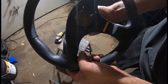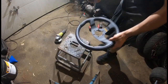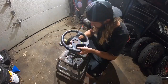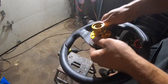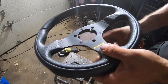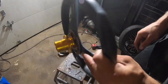Looks like we got a problem here. The three allen keys don't fit in the steering wheel. I'm just going to hit them with the grinder and make it work. Here's the final piece — we got our quick release and our modified allen keys that lock into the steering wheel. It would have been so much easier to just cut the steering wheel, but I did not want to ruin this Momo wheel, so cutting these little allen keys was the way to go. I need to get three more nuts, but for now three and three is good enough — let's go put it on the go-kart.